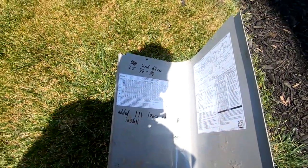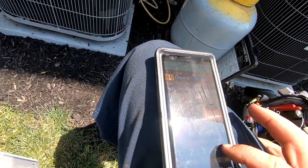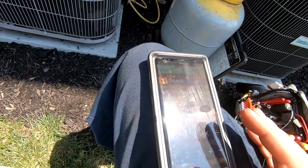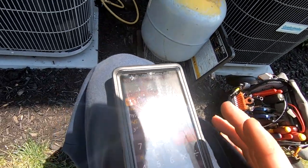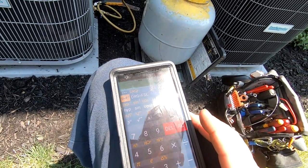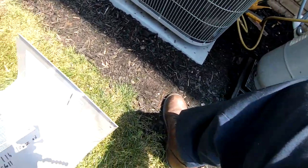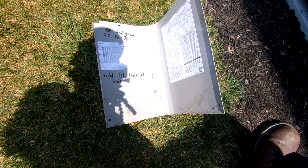Generally, these things are charged for 15-foot. So if you take 15-foot off of 55 — so 55 minus 15, which is pretty cut and dry, it's 40-foot. Take that times 0.6 ounces, which is what your 3/8th line is. It should be about 24 ounces. Subtract 16 off of that — that'd be one pound, eight ounces — and they added one pound, 10 ounces. So they've added about the right amount for it.